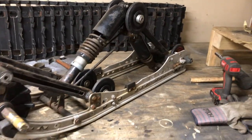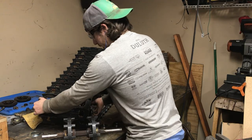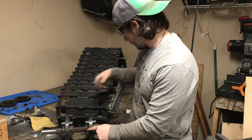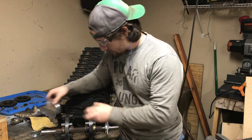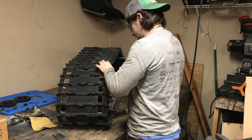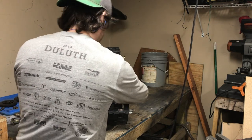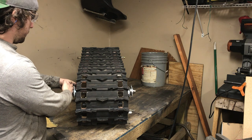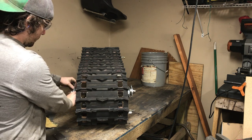Here is the finished product — everything's a lot lighter, all the wheels are to the inside of the track in their proper grooves. I've finished turning the drive cogs down to about an inch. Now looking at how this is going to work: thin pieces slide onto either side like so, sitting on the inside, and this will connect to the piece of wood — which for now holds the connection to the frame on the bike. One side is a little longer to fit the drive sprocket that will go to the jackshaft driven from the actual motorcycle.